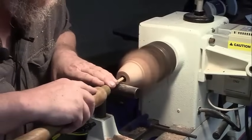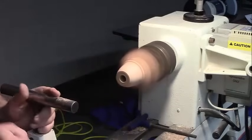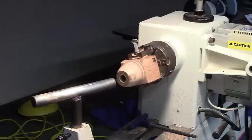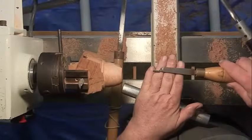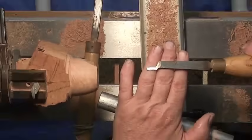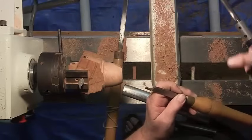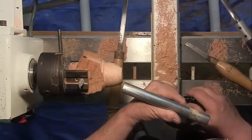If you're trying to push a serrated tool into an opening and you have a bump or ledge, it will slow the speed. A thread is a spiral — it's actually a straight line with no deviation. If you start introducing deviation, that's called a drunken thread, where it'll go around and then jump forward. It's fairly important that the surface in here is parallel to the lathe bed. If it tilts one way you'll only catch on the first thread; if it tilts the other way you end up with a pipe thread, and it'll only lock at one place — which may not be airtight. You really need something to touch on the flat surface to be airtight.